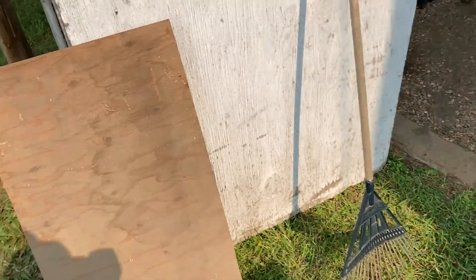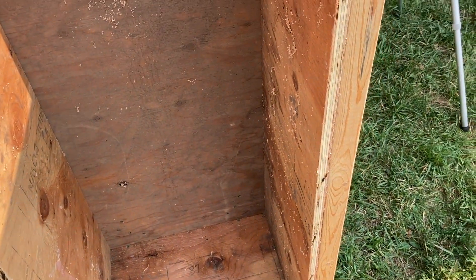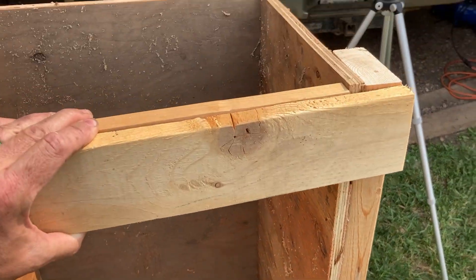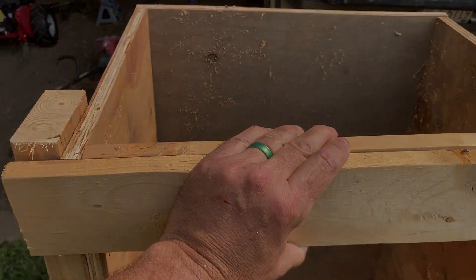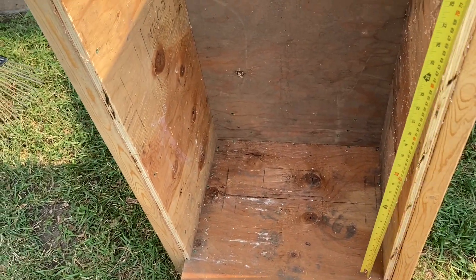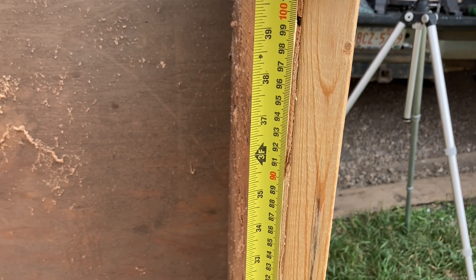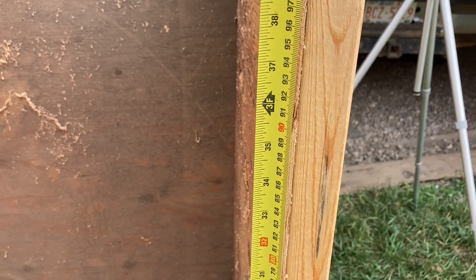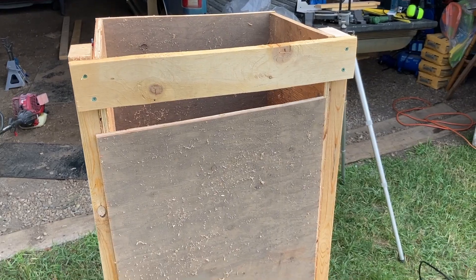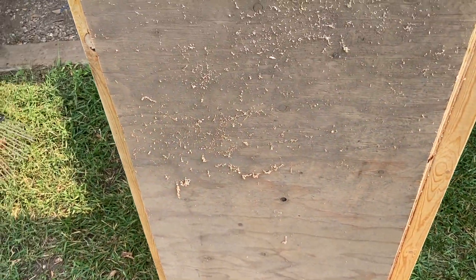With my cross piece, I measure about 40 inches to the top. If I cut the door to 38 inches, that'll give me an inch on top and an inch on bottom — lots of space to be able to swing that door back and forth before I get too close to mounting it with hinges.